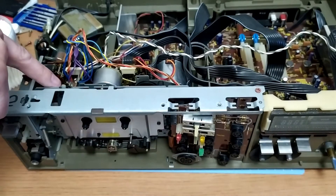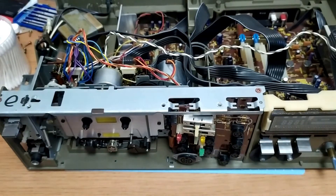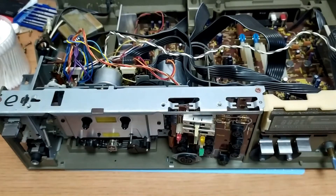There's a belt in there that looked okay, but in fact it had gone quite hard and a little bit stretched, so it just really wasn't turning. There was no velocity in the spin, so it was slipping quite considerably — just wasn't enough to activate anything.